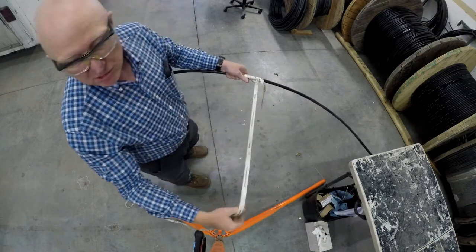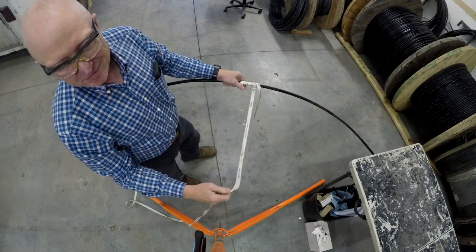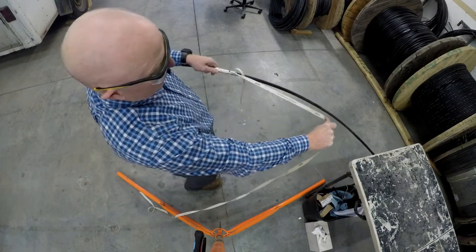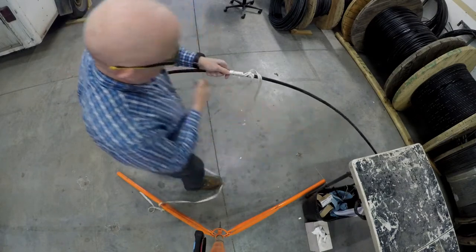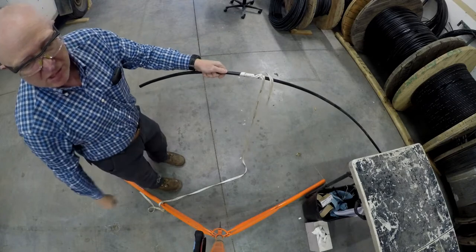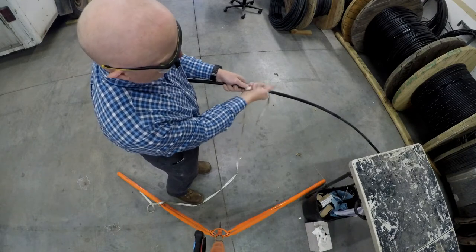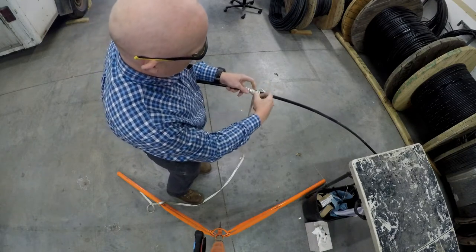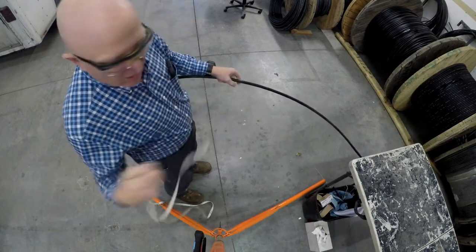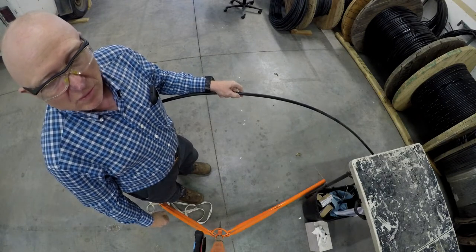Now, this long section of your mule tape or rope, you would tie it to a fence post, tie it to a tree, tie it to your trailer hitch on your bumper — something solid that you can pull against. When that's secure, you pull the cable this direction. That knot will not slip. It's a very efficient knot. And when you're done pulling on it, this knot doesn't really tighten where you can't loosen it. All you have to do is loosen it up a little bit, undo your two clove hitches, and the rest of it just falls apart. Very simple, efficient way to get a grip and be able to strip your cable when you're by yourself.